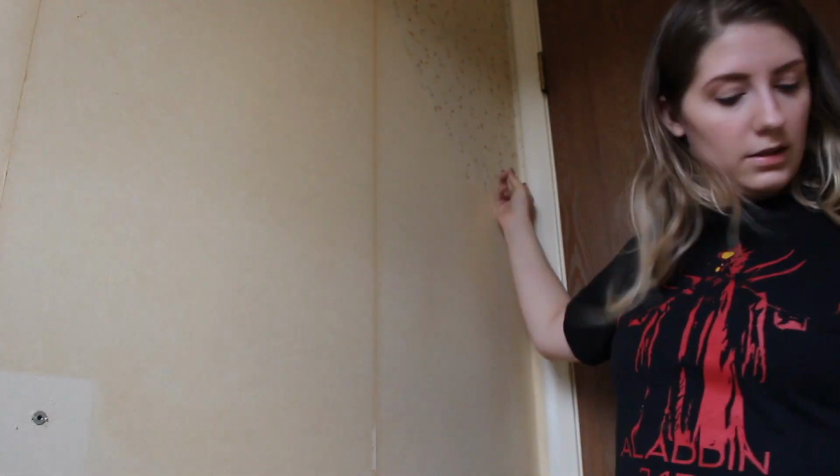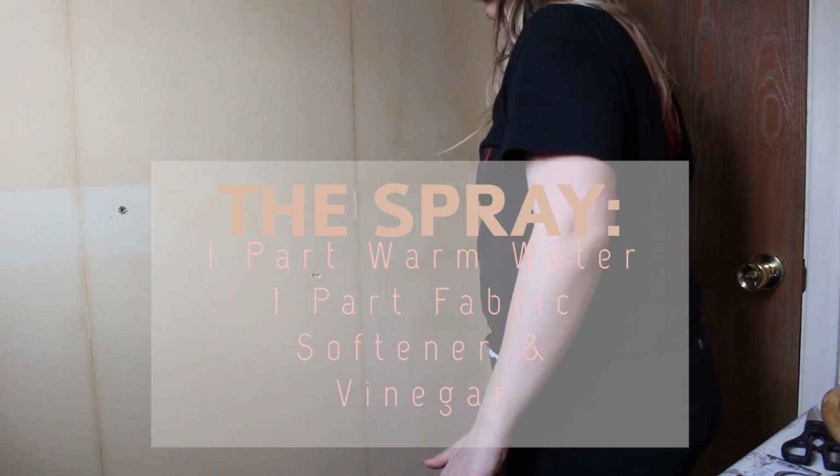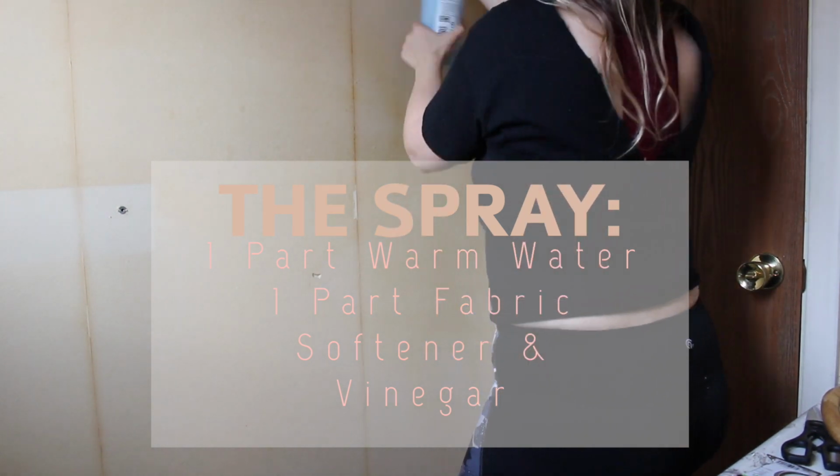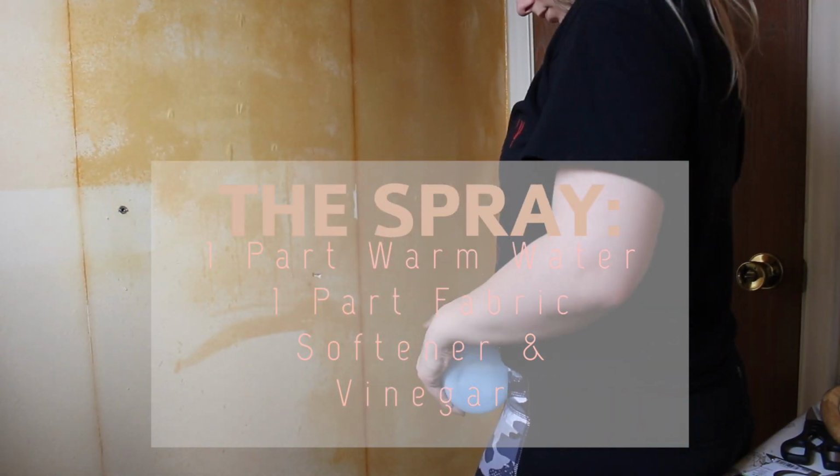I did some research and found the best way to remove the top layer of wallpaper was simply catching an edge of the paper and lifting from the seam. The bottom layer, however, is a bit more challenging. What I did was get a spray bottle and fill it with a three-part mixture of hot water, fabric softener, and vinegar. This breaks down the wallpaper paste that originally was poorly placed onto my particular room and allowed me to come in and scrape it off.